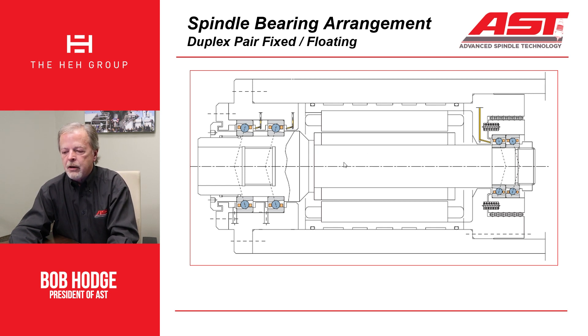What you have here is a mismatch in size and capacity. You can see the difference in size between the front two bearings and the back two bearings. So if all these bearings are 15-degree contact angle, there's a high likelihood that the small back bearings are overloaded trying to put enough preload into the front bearings. What we would do in this case is use 15-degree contact angle bearings in the front and go to 25-degree contact angle bearings in the back to better balance those preloads.